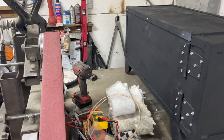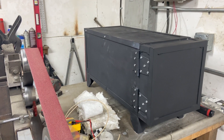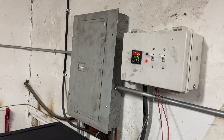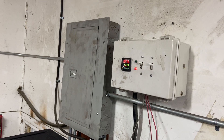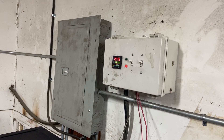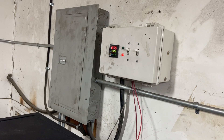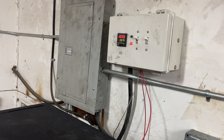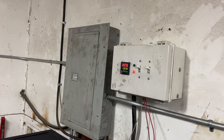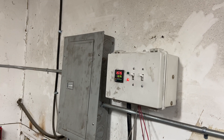The big question, at least on my mind, was whether that ITC-100 is worth it — whether it did anything to perceptibly change the efficiency or operation of this oven. If any of you saw my last update showing the PID controller after soaking at set point for an hour or two, you may recall it was swinging pretty noticeably — probably plus or minus five or six degrees, so about a 10 to 12 degree fluctuation. Right now, after soaking at set point for about an hour and a quarter, it's easily holding within one degree or better, and it's been that stable since about 10 minutes after hitting set point.